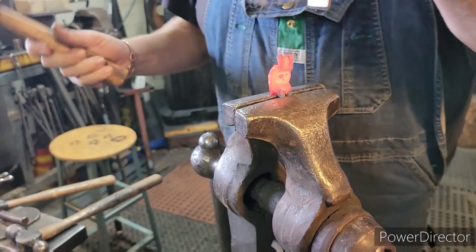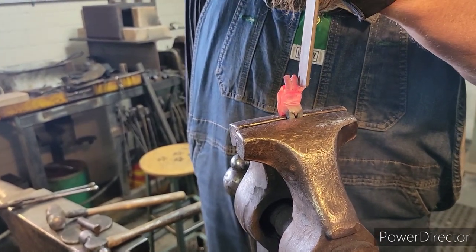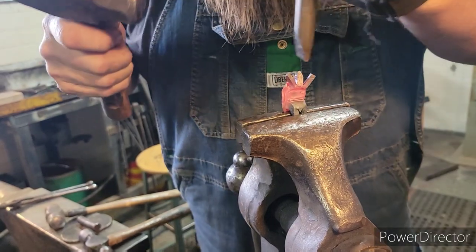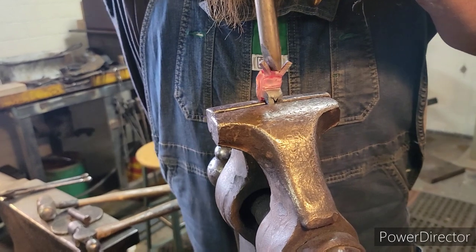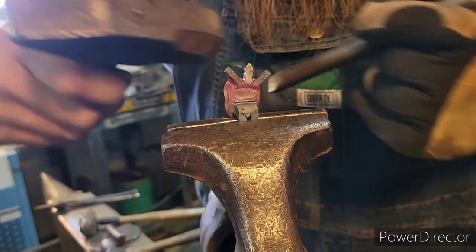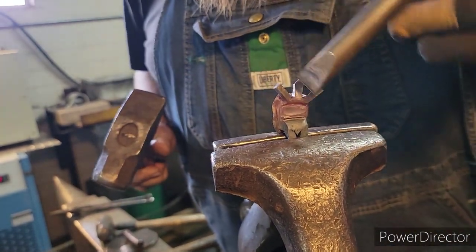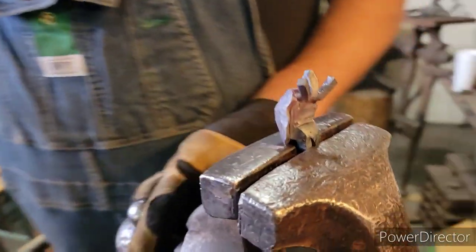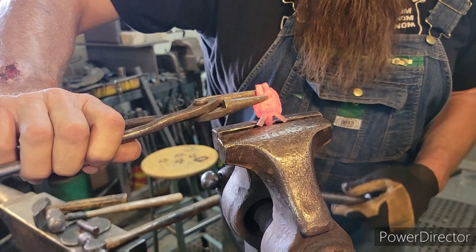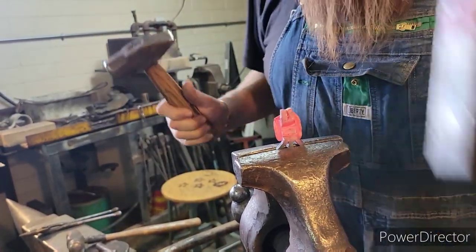Okay, so we're going to put him in like this, holding on to his legs, so that we can get these legs moved out. Sneak that in here, where we made our cuts. Bend them out a little. This is a very skinny fuller. Come in. Tap it. His head's already wanting to kind of come up, but get in between here. Go as clean as you want. Get his legs moved out, but don't bend them over yet. Side. See, it lets me grab onto something by having his legs and his head still there. Move these legs out where the tail is.